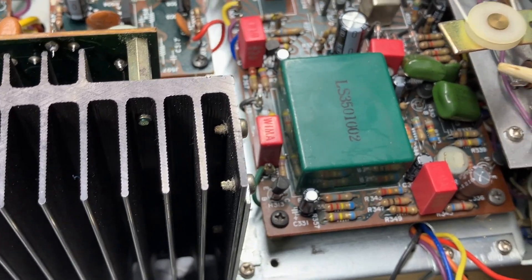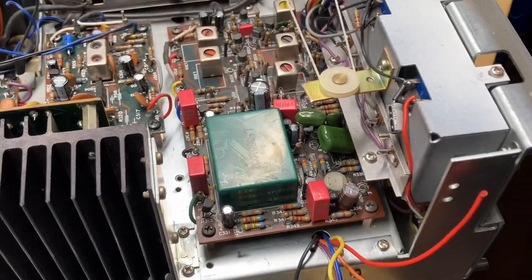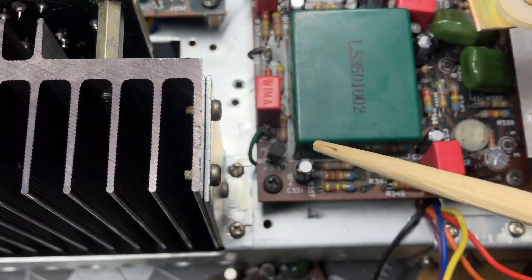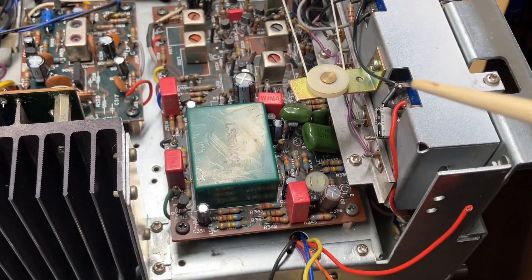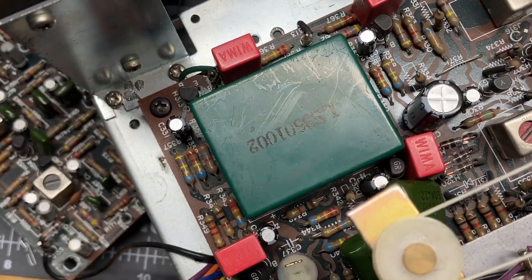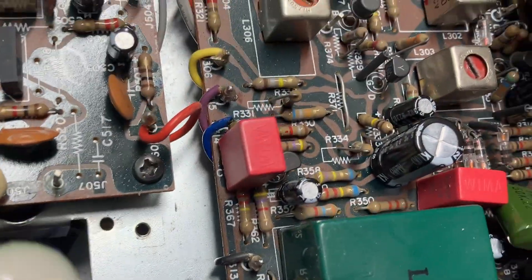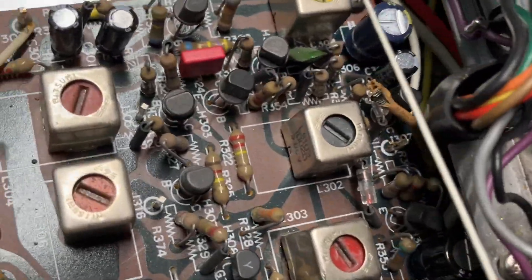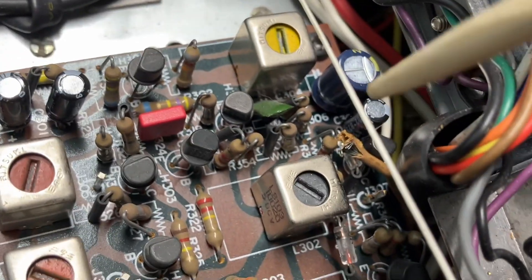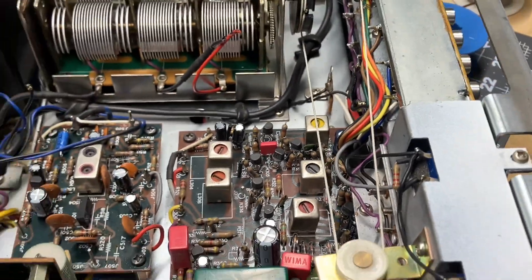You just have to be careful and you can work it up. I didn't cut any of the wires on this side — I left all of these attached because this side flips right up. When you get the multiplex board bolted back down with these screws, be sure your brown wire is not trapped under the board. So very important, otherwise you're going to have a problem.